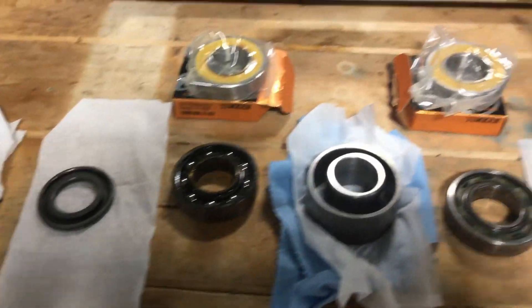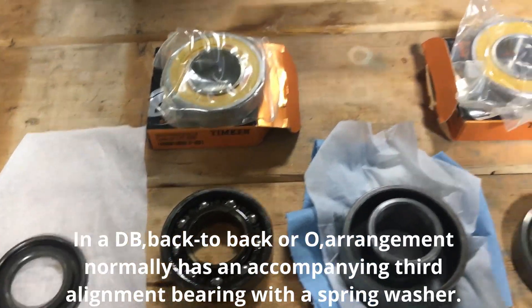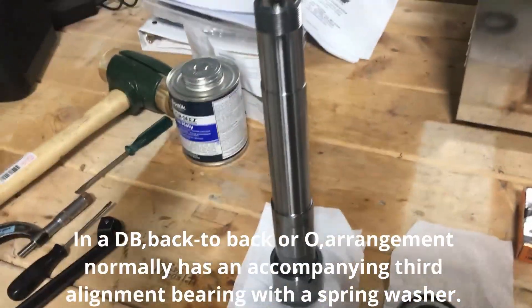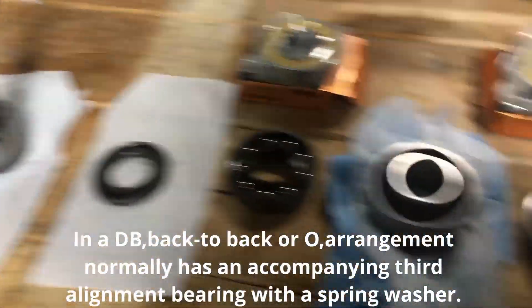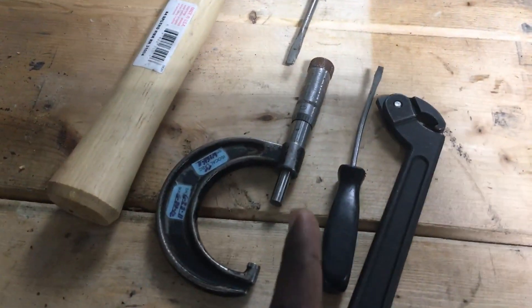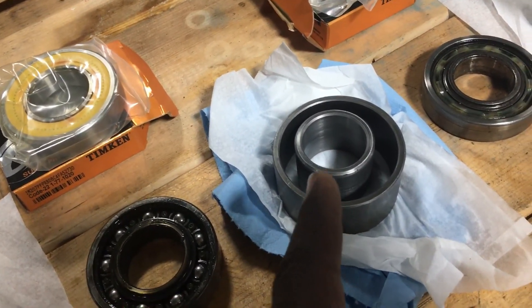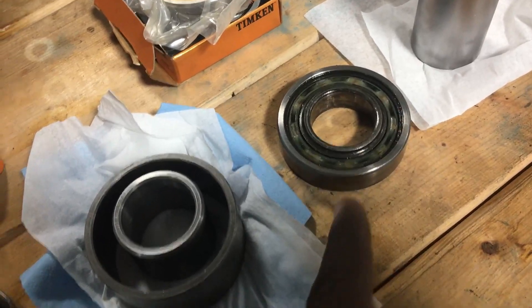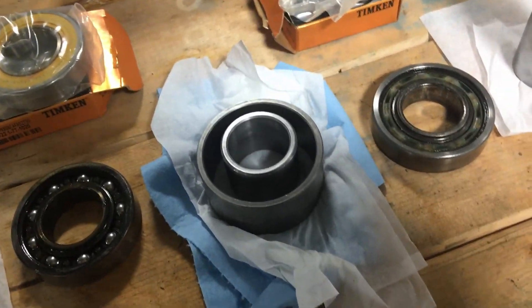These two bearings are critical in terms of orientation — you basically want the letters facing each other, that's what it boils down to. In terms of picking the right bearings, just buy H&W's bearing kit for redoing your spindle — story's done. This one is mainly for alignment and goes up here. These are the tools I used: my one-to-two inch mic for measuring here and here. This bears on the outer race and this on the inner race — they have to match or you'll impose a moment onto the bearings, which you don't want.